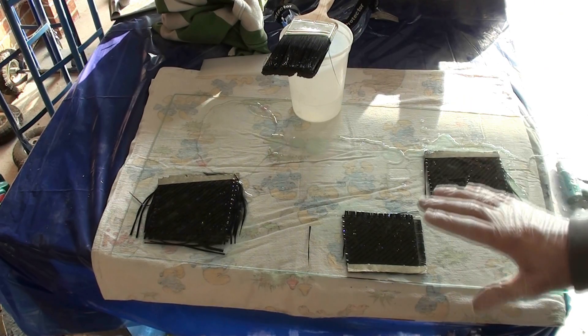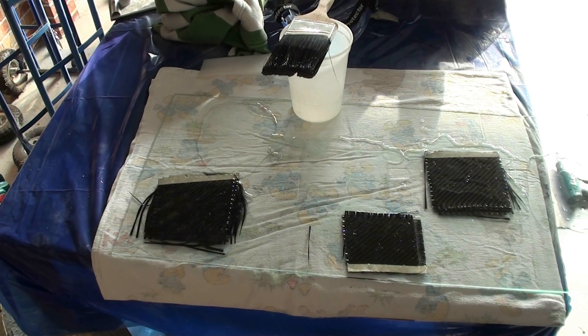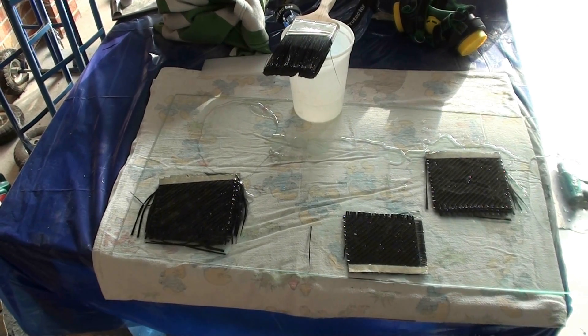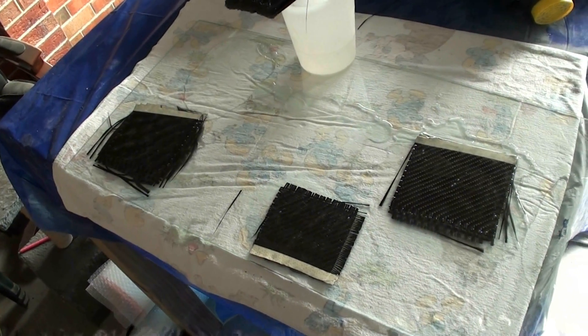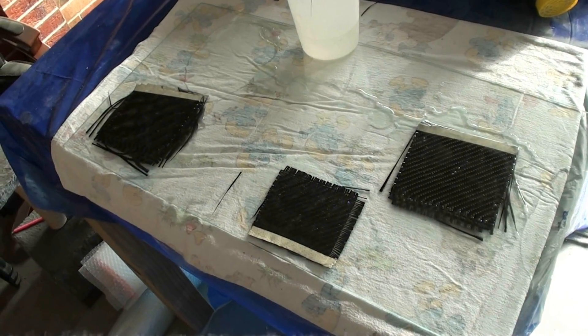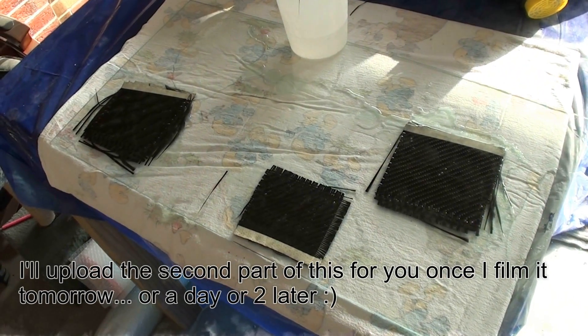This is how most things get done: first the clear coat gets rubbed on, then when it's gelled and it's kind of leaving little fingerprints — I'll show you with the camera — when it's kind of at that stage where it's just gelled, then it's ready to have carbon fiber laid over the top. When it's basically hardened and cured later tonight, or perhaps I'll leave it overnight — yeah, that's probably the best idea. Tomorrow afternoon I'll take these off and compare them with a vacuum-infused piece about this size that I have.